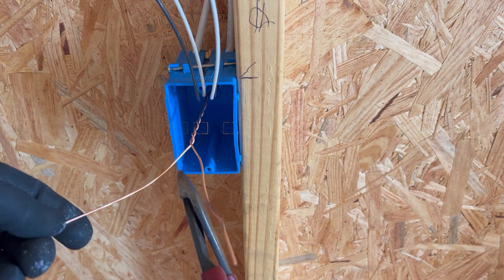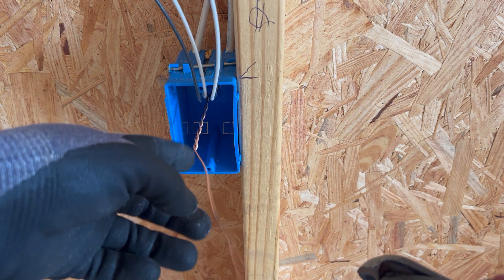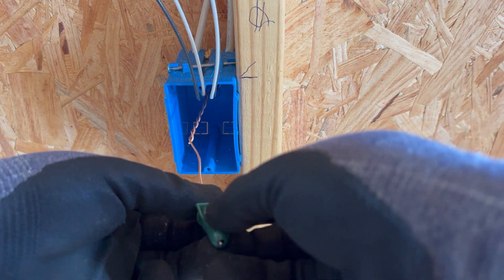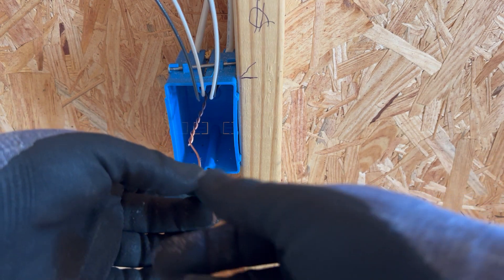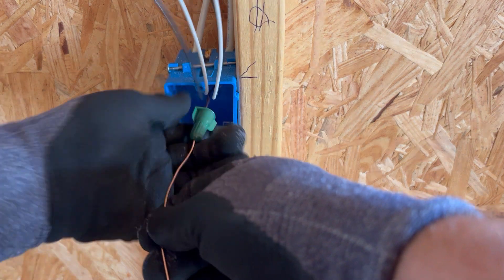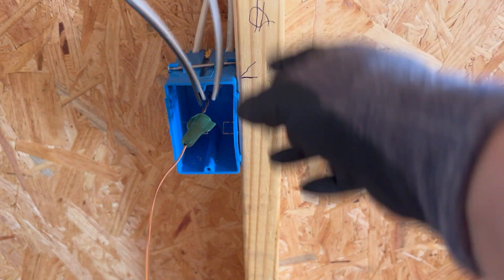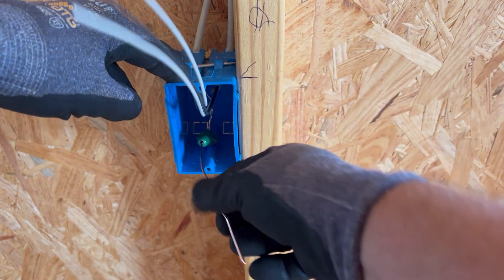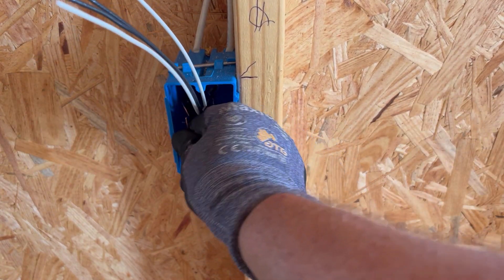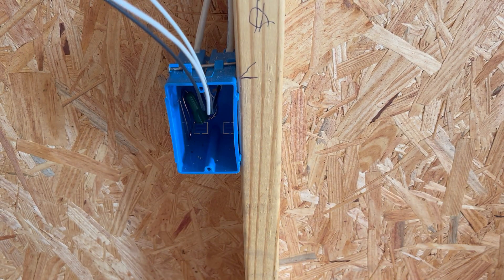Take your diagonals again and cut one wire off — doesn't matter which one — close to the other one. Here's where the green wire nuts come in handy. Slide that wire nut on there — see, that's why there's a hole. Slide it over where the other ones are, and twist it clockwise until it makes a good connection. Shove it into the back of the box. Use your thumbs to push it, preferably the ground on the left-hand side — that's where it's going to end up come trim time.